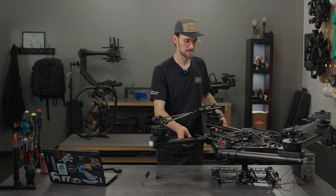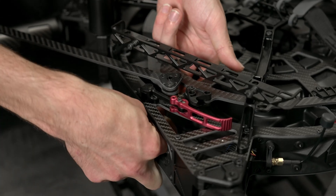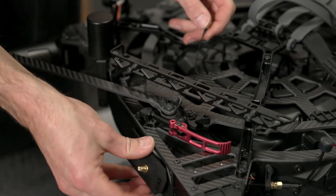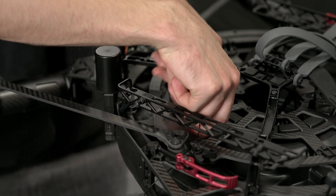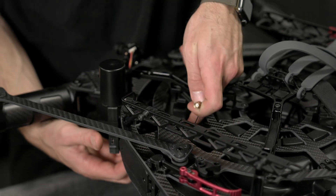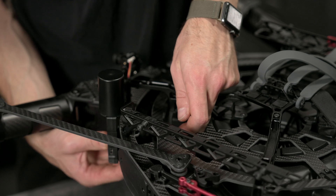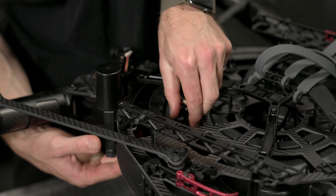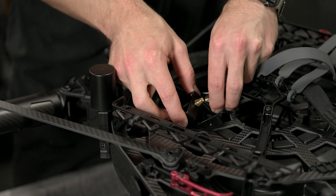Once you have those two cables attached to the back of the FRX, it's time to attach the SMA extension lead. It's good to do this before we screw down the FRX Pro, just makes it a little bit easier. I feed it through the door underneath all the carbon plates and then up through this hole. At the same time I bring the FRX Pro up through the same hole and then you can attach the SMA outside the chassis, which just makes it a little bit easier.